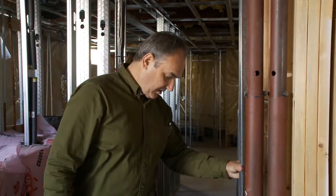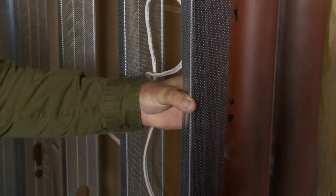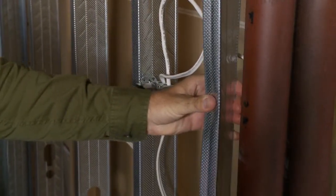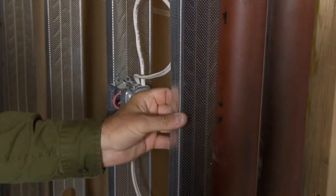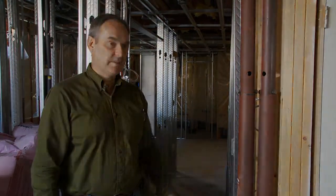Just looking at the studding here, this is really bad. They didn't put any screws at the back of the metal studs, so these warp totally. As soon as you get a stud that's not 90 degrees from the actual surface of the drywall, you're going to get weakness — it's only good for lateral support. That's the downside to metal studs. Wood studs actually give you a lot more support and they don't twist. Once you kink it, it's totally zero strength.